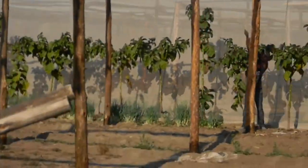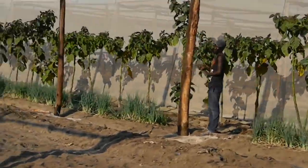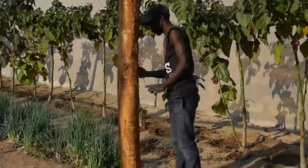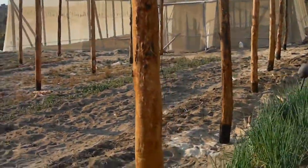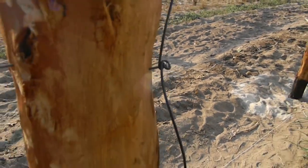However, before we fasten the poly wire to the grounded metal rod, we first temporarily tie it to a nail about 1 to 1.5 meters above the ground. Since this is temporary, leave an adequate length of poly wire enough to bring to the ground later on.